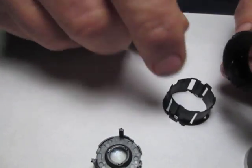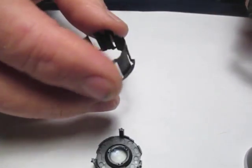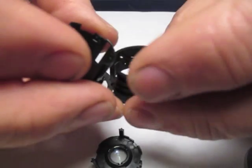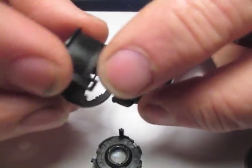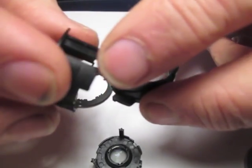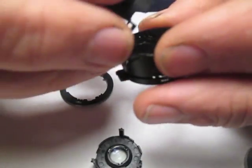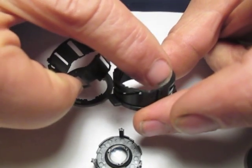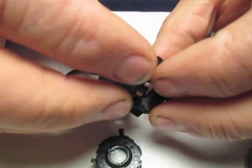The secondary indexing group consists of our secondary rotating indexing ring, our secondary indexing sleeve, and the sleeve retainer plate. We're going to start by looking at this from the front and putting our indexing tabs into these little tabs on the edge, into the clockwise-most grooves — the parallel grooves of our insertion grooves. There are three sets of parallel insertion grooves, and we have to put this into the clockwise set.